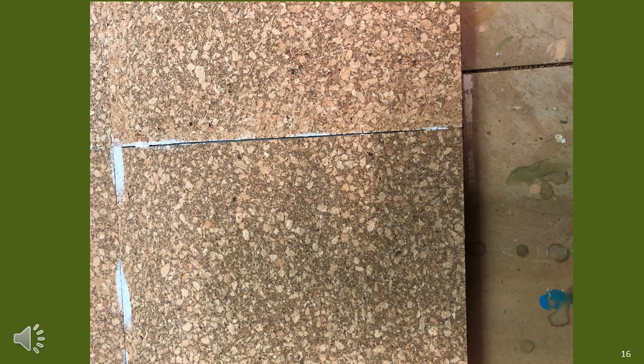It could be the tiles change in size when they are glued on an MDF board, but I suspect they're just not all the same size, or maybe temperature changes their size. For 3 edges of your 60 cm tiles, this is the effect you'll end up with. Once you apply wood putty and sand it down, the MDF board will show as a slight indentation, which is not a big issue. Along one of the edges, you'll have a 5 mm gap.